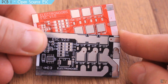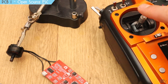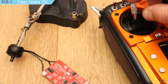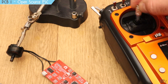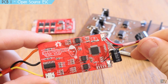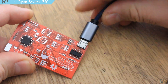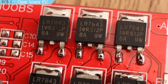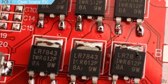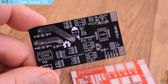The board can reach very high speeds. It uses analog interruptions with the internal comparator and controls speed with PWM input just like any commercial ESC. It also has a buzzer, LEDs, an FTDI programmer for USB programming, and on the back a triple-phase MOSFET bridge with MOSFET drivers. I'm very happy with the results and I'm currently working on making it smaller with a better and faster back-EMF algorithm to share with you.